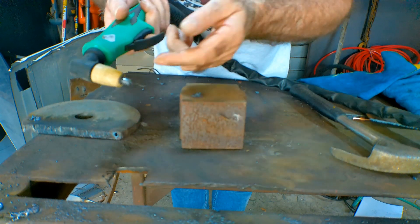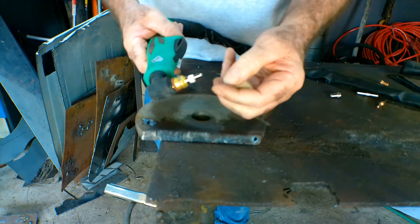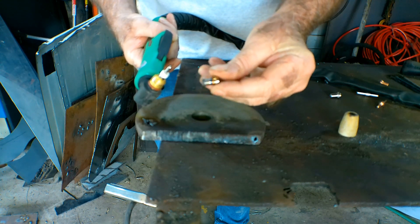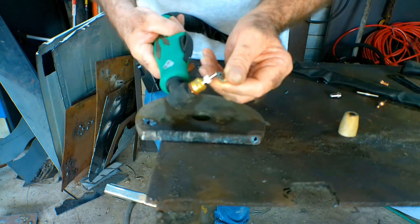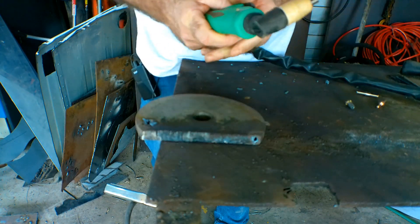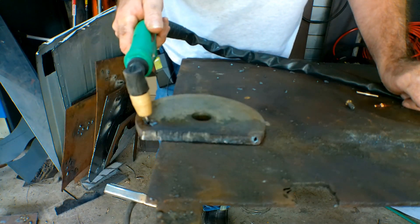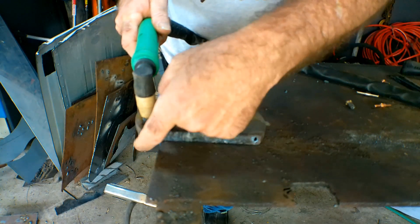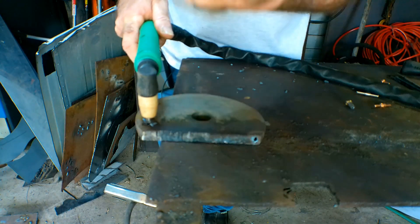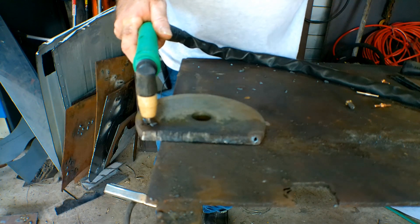What the hell? I want to cut this thick. Well, you can cut that thick — you just don't want to start from the middle. Because I buggered this tip the first time, I'll just change the tip out. The electrode's still all right but the tip is knackered. See here, it got really really hot, it's gone blue. These things get hot, but they shouldn't go blue. The hole's buggered in it and it's all horrible on top, it's just melted. So we'll put the new one in and as I've already blown a hole in here, we'll start from here. You notice I'm already starting it through the hole — when I pull the trigger, watch the sparks come directly out the bottom. We've got a direct passage straight through, so it's not coming up through the bottom and hitting the torch. As long as you can get a free flow through your cut, your tips will last a million percent longer.